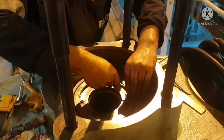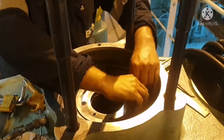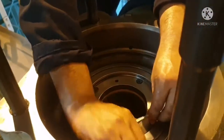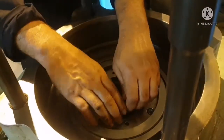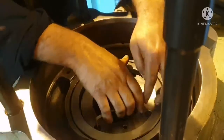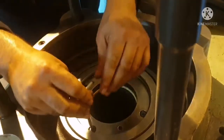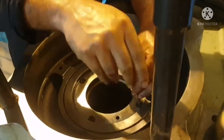The changing procedure is very easy. All you need to do is loosen your Allen bolts. You can see there are four Allen bolts securing the seal rings. Loosen all four and ensure you are using the correct size of Allen key so that you don't damage the screw head. Now you can see we have loosened almost all four Allen bolts.